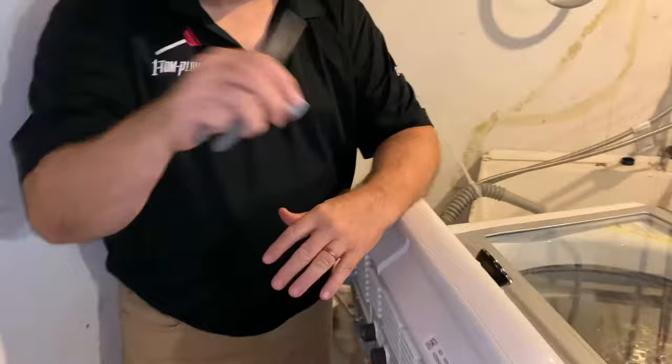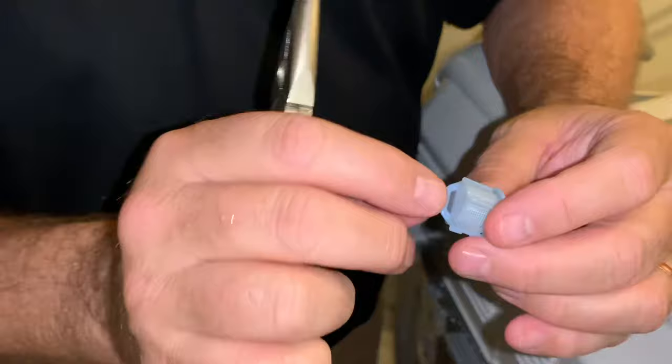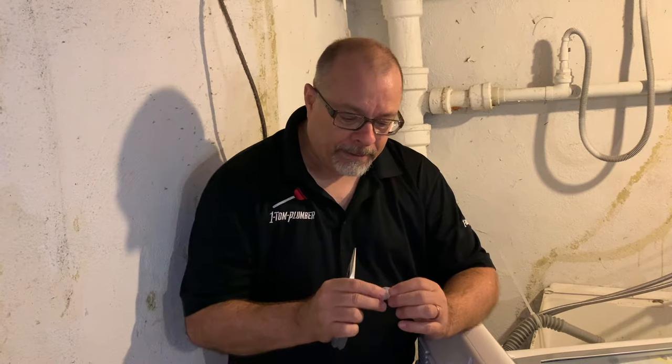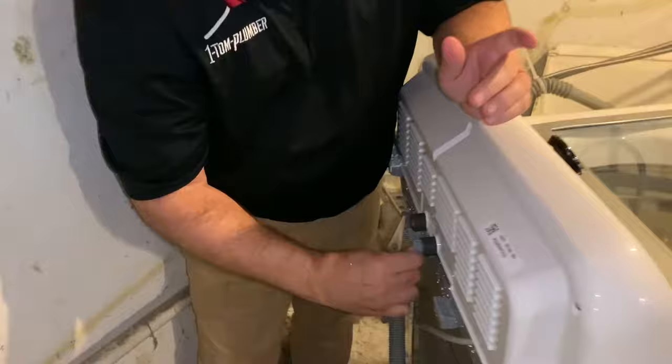All you would do is take your needle nose pliers, pull out whatever you want, wash it off, rinse it off. Now if you see hard water minerals on this — calcium buildup, stuff like that — what you're going to want to do is leave it in white vinegar for a few hours and then wash it off. White vinegar will dissolve that calcium and scale and all that kind of buildup. If you have a water softener for your entire home you probably won't ever get that buildup, but in most cases since most people have hard water you can get that — and that's what you see on your shower head and that crusty stuff everywhere. Once you're done, you simply just pop it back in and reconnect everything.